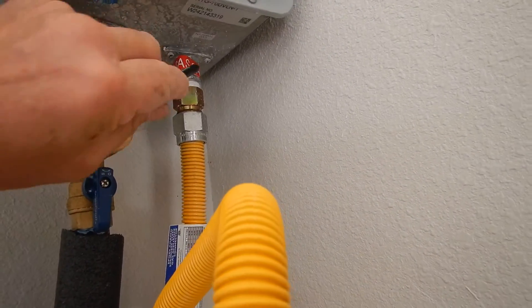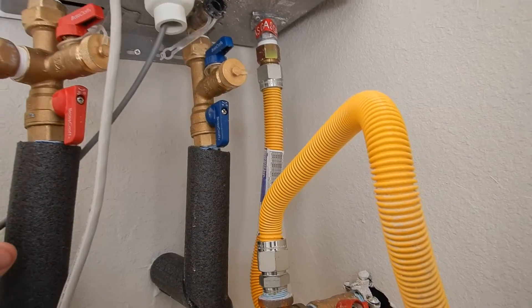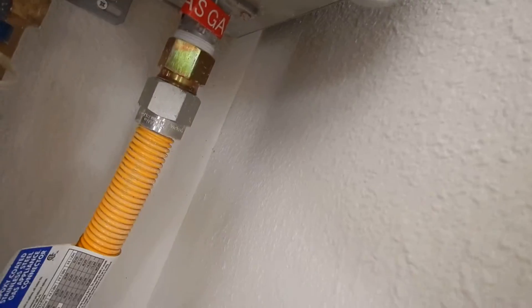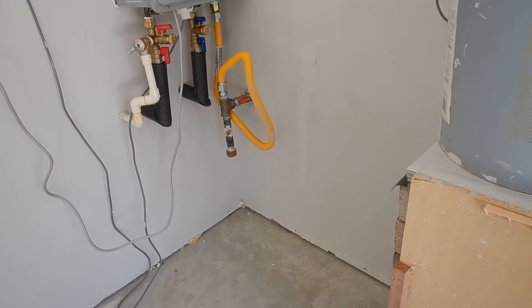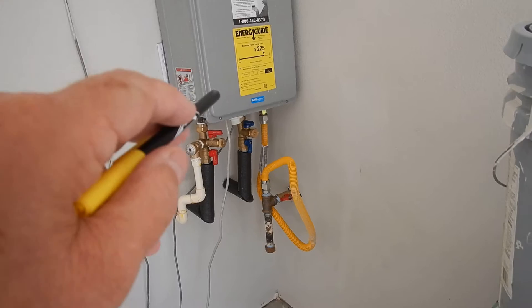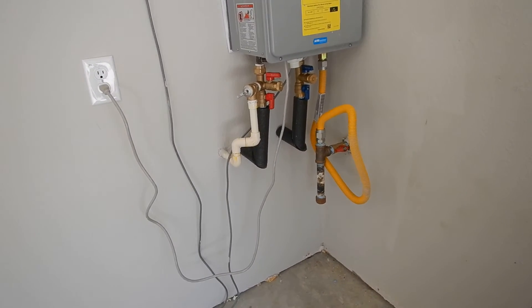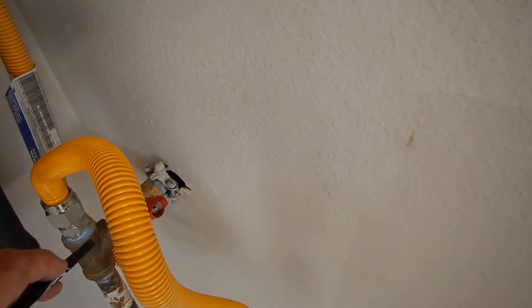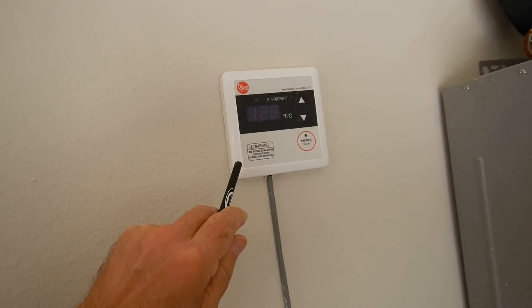The installation wasn't complete — the plumber was in a hurry. He probably doesn't even have a manometer in his truck. So what did we learn? We've got white tape on our gas connections, and the gas connection wasn't dialed in with a manometer. Everything else is just informational — and this is where you change the thermostat, this is where you change the temperature.